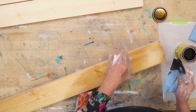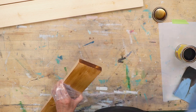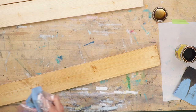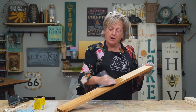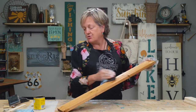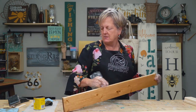It's actually six sides, because we also have the end grain. The end grain is always gonna turn out really dark. We're just gonna pick up our other towel and wipe that back. Keep your gloves on — you can work methodically and just get everything stained. Some newspaper or brown paper bags underneath your work area would keep everything nice and tidy. It's important that you don't allow stain to dry in a clump and then restain over it — it could make a gnarly little mess, so be careful of that.